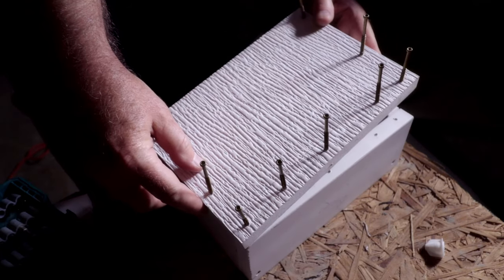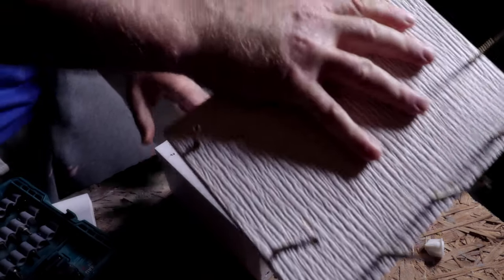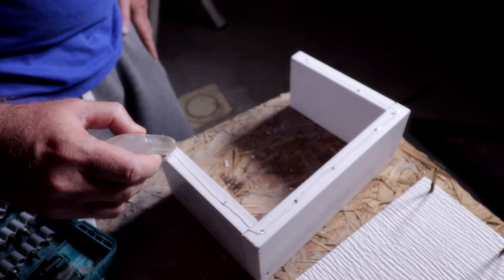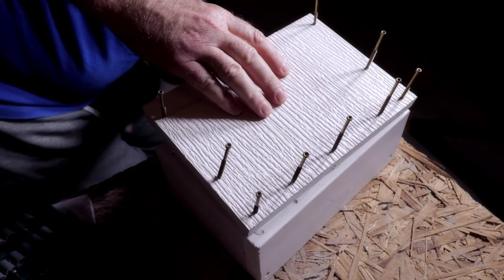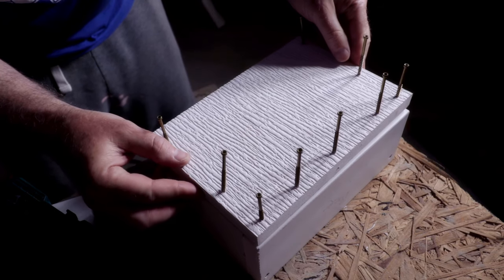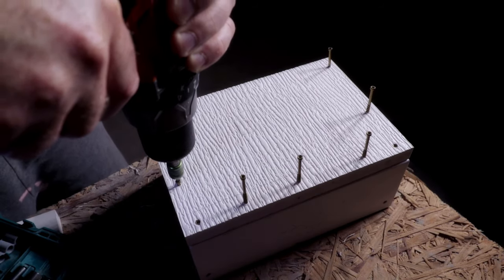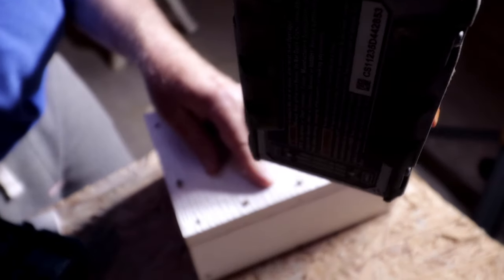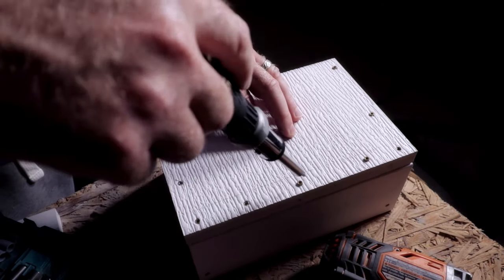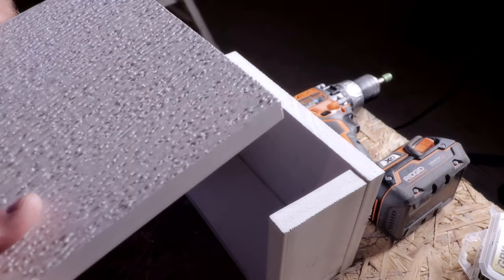You want to make sure you have four corners with the screws sticking out — the rest are submerged. Line this up, make sure those holes all line up. Once it's lined, pull it off and put a good bead of glue — go pretty heavy with it; it will leak out a bit but you can just wipe it off. Take it with your four corners, line those up, place it down, and screw in each of those four corners all the way down. I get my power drill but leave the heads out, then use my hand screwdriver to countersink them so you don't strip anything.